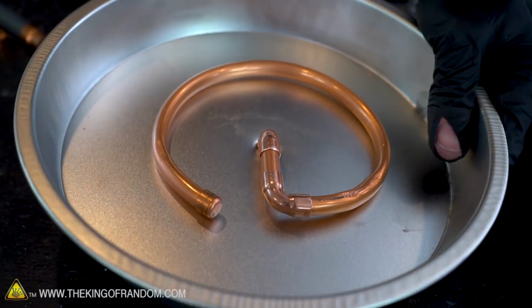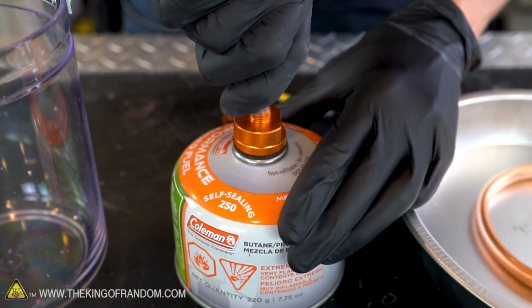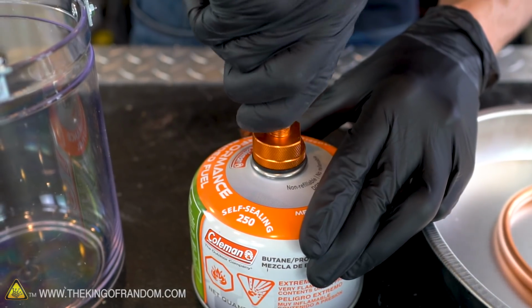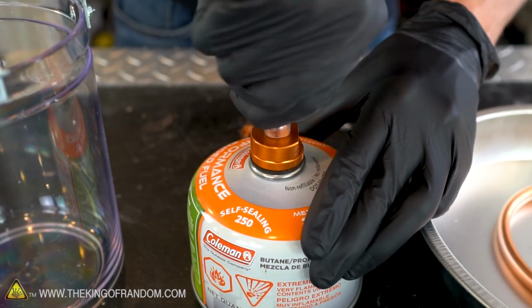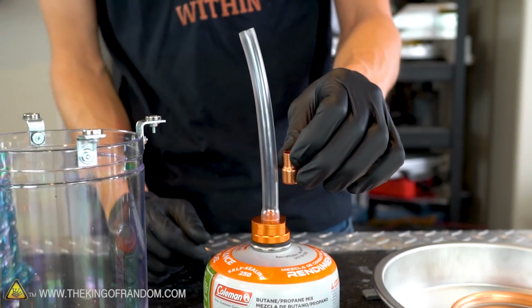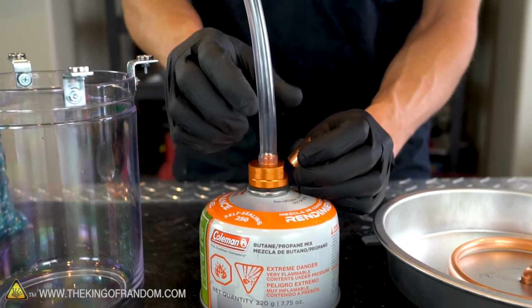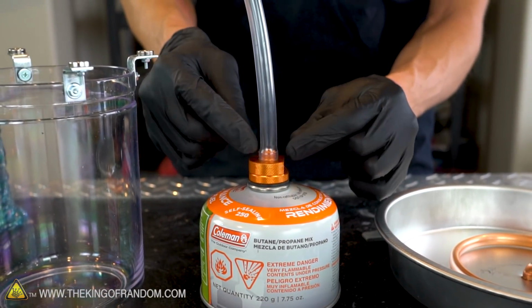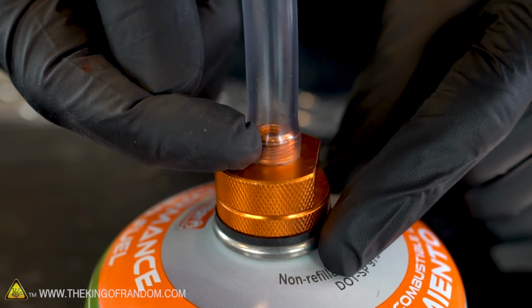With our regulator in place, our 3/8 inch vinyl tubing should fit very snugly over the nozzle. In fact, it's snug enough that when I twist it, I can get it to fit down onto the threads, and that actually helps tighten it into place. The reason I'm using vinyl tubing instead of metal hardware is that I could not find any other metal hardware that fit nicely onto this thread. It seems to be a size that doesn't conform to standard threading.